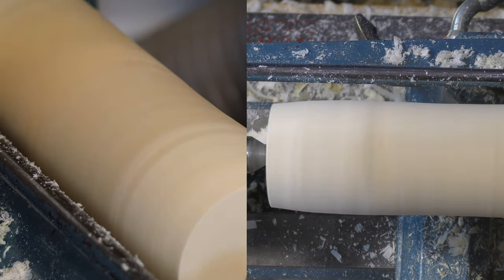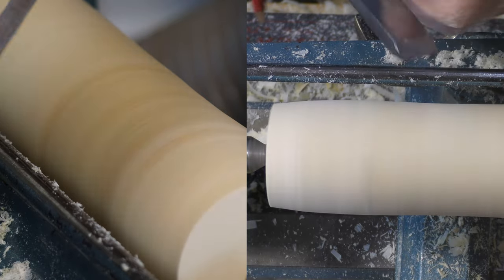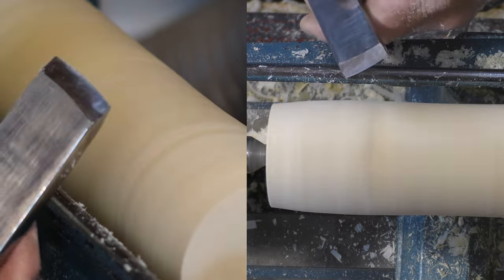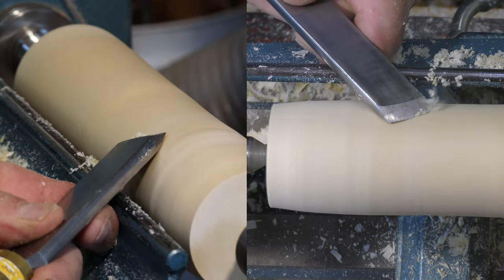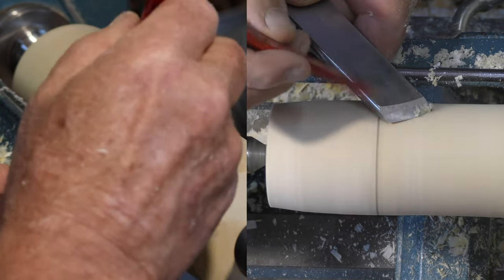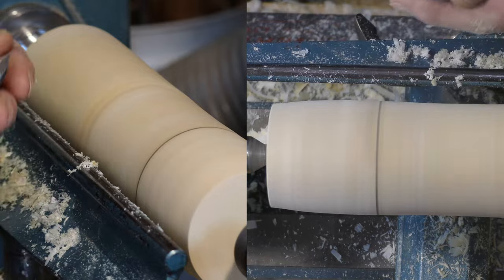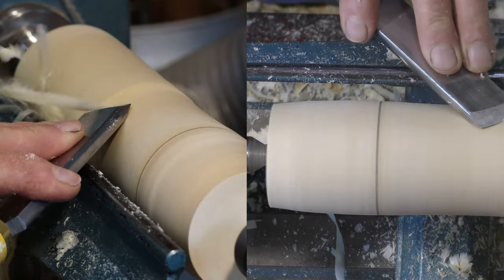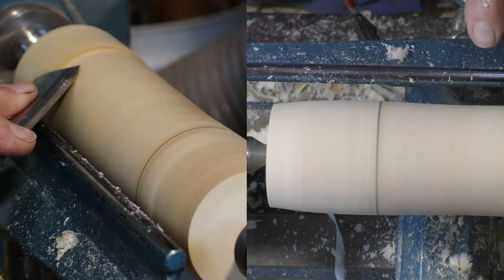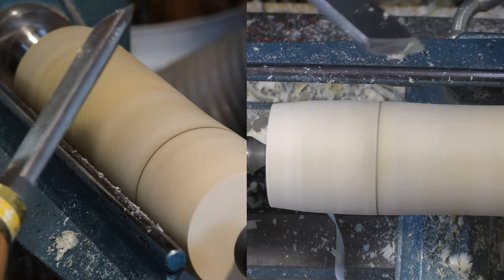A few little knots — this is a piece of fairly damp box elder, which is what I've got at the moment. I generally do longer cuts — with long coves and cylinders — using the long point down. When I'm cutting there, the fulcrum is back here, so that's where the wood's coming in. I've got a lot more control of the leverage, and any pressure I put into the cut tends to go parallel to the axis, absorbed by the headstock end so to speak.